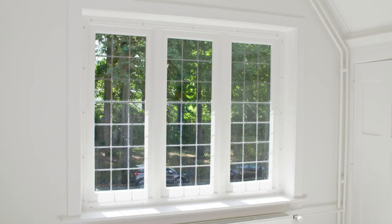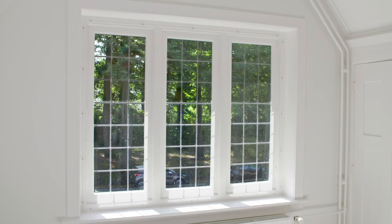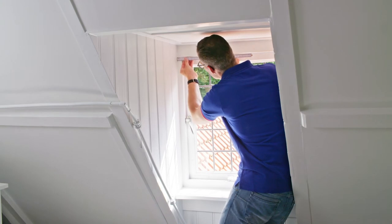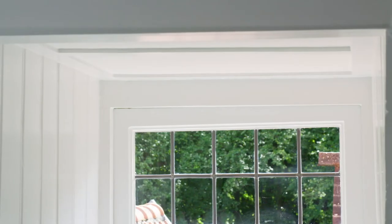In the description, you will find a link to our handy step-by-step guide, the measuring instructions and all the necessary products. Is your frame narrower than 3.5 cm, or is your window larger than 2 m? Then the fixed installation is often a good alternative. For sheets longer than 2 m, choose a thick secondary glazing of 5 mm.